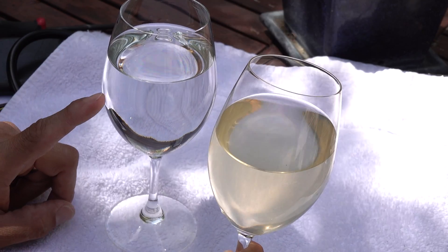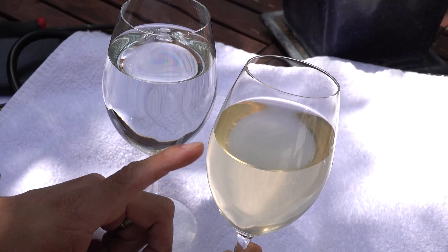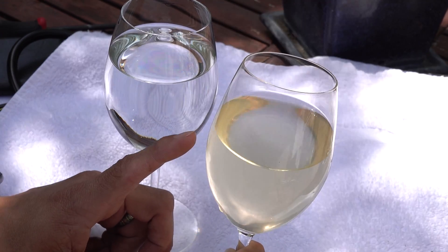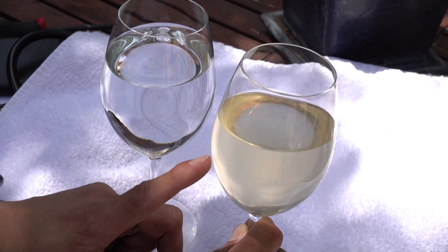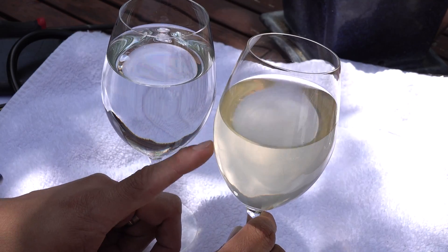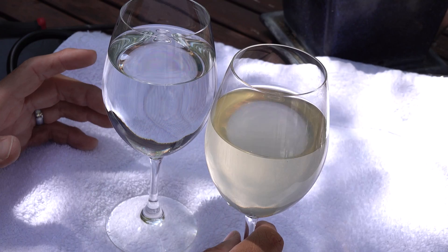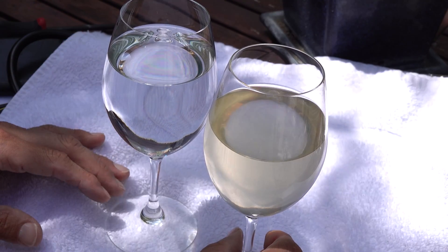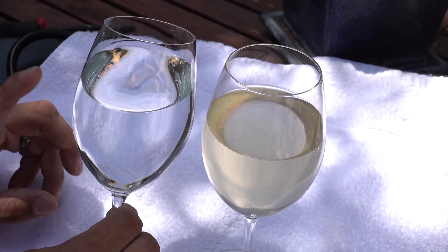This glass obviously has some floating solids in it — that's part of why it's not as clear as the other glass. But it also has dissolved iron and dissolved manganese. If you have problems with iron buildup on your white porcelain, or if your laundry is slowly turning orange over time, this is a problem you likely have in your water. Ozone is going to be a pretty easy way to take care of this, especially if you live in a rural area where you have a cistern because your well pumps a little too slowly for house use.